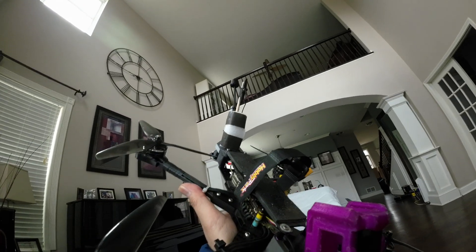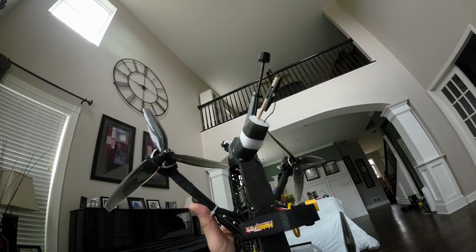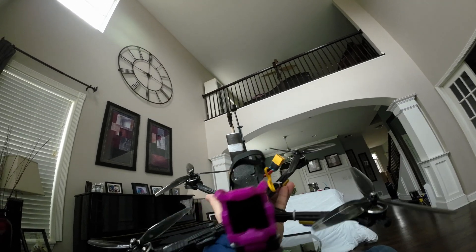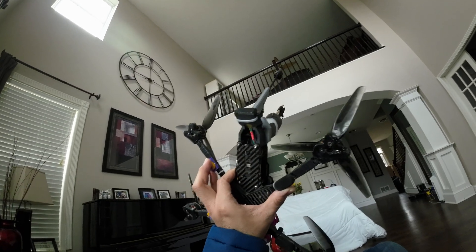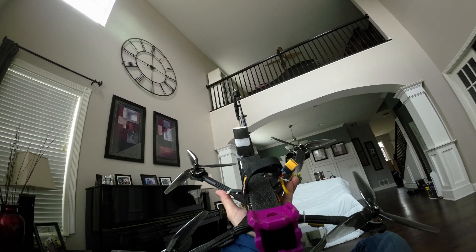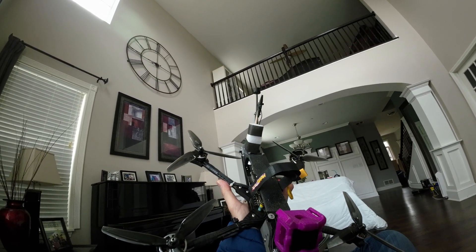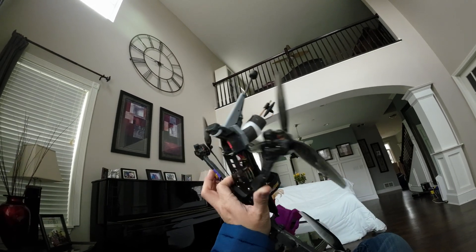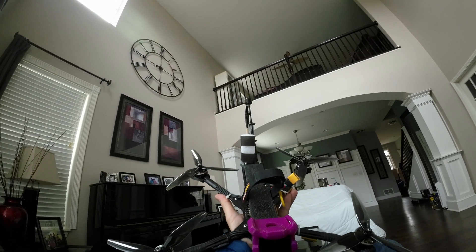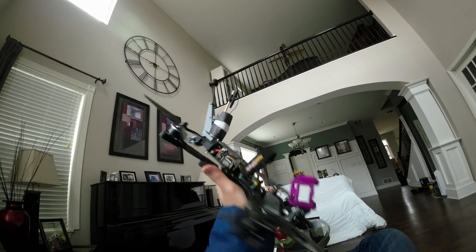I placed the styrofoam in such a way that cold air is prevented from entering the receiver. The telemetry TSNR was actually showing negative 4 dB versus the RSNR which is negative 22 dB — which is still good. The negative 4 is putting out a lot of power, maybe because it's warm, and that's based on my bench test.